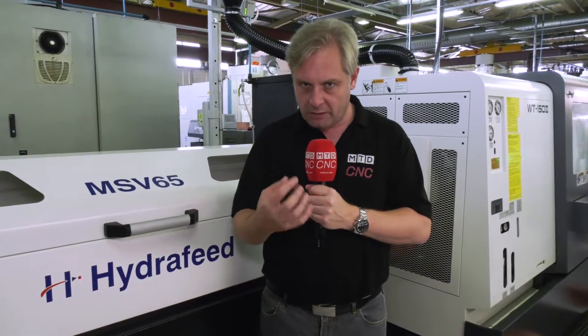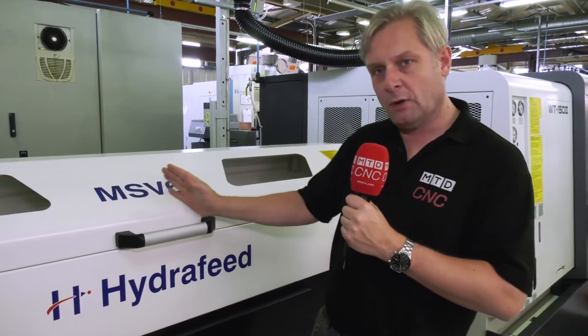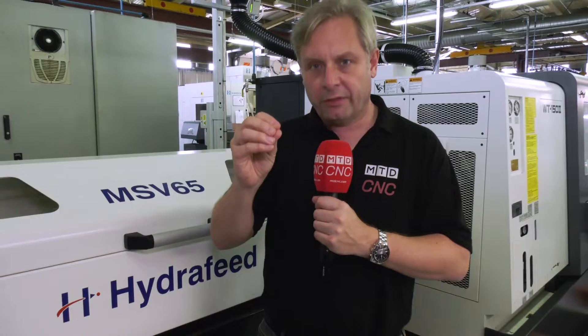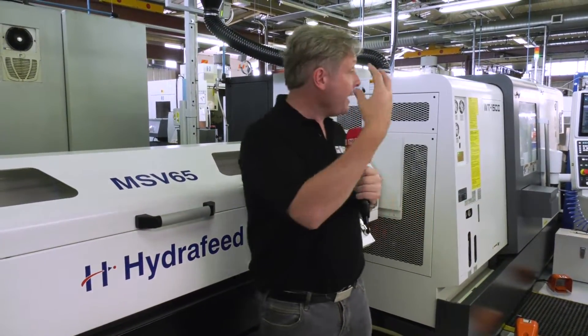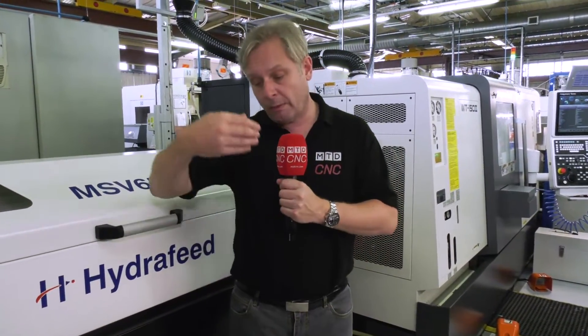Another thing is remnant - always an issue on your bar loaders, bar feeders, whatever it might be. But this is another point of the CNC. Take an example: you've got a one metre bar, 10 centimetre components, pushing those through with the CNC bar loader. What will happen is on the ninth component it'll machine that, but working in conjunction with the machine tool, you know the next component is essentially remnant. Generally with a standard bar loader that will just fall in, but because it's CNC, you can program that into the machine - on that tenth one it'll pick it out and actually put it in a parts capture. That means the remnant won't drop into the machine and potentially damage it.